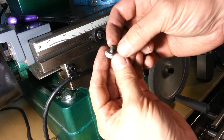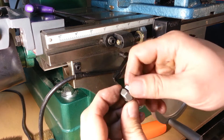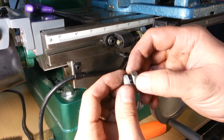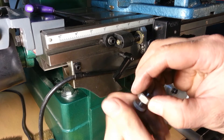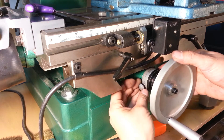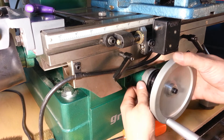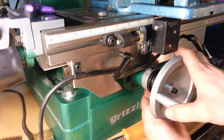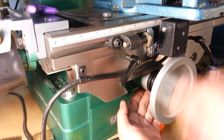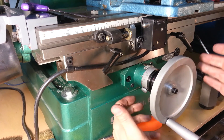Also, since I cut it short, it is not currently locking, which is its only function. So I'm going to have to put it in the lathe — make this part a little bit longer so it actually engages, and make this head part a little bit shorter so it fits under. I've taken this screw and put it in the lathe by the knurled head using some aluminum shims, got it centered up reasonably well. It's a hand screw so it doesn't actually matter. Now I'm cleaning up the threads with a tap — 5 millimeter, 0.8 millimeters per thread. The main reason we're doing this is to make sure it fits under the y-axis. It goes all the way down and locks. Moment of truth — look at that, goes right underneath perfectly. Problem solved. Surely I was not the only one having this issue.